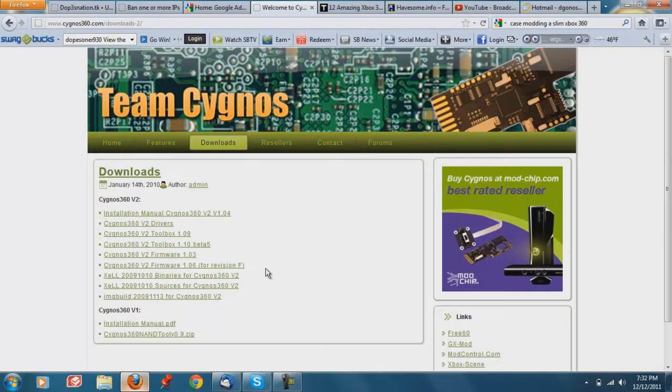Make sure that you have your Xbox 360's power plug plugged in, but don't turn on the actual Xbox 360 — just like when you're reading the NAND, just have the power plugged in. Then go ahead and get your USB cable and connect it from the Cygnos to your desktop or laptop or whatever you're using. When you originally plug it in, just like in my other driver install tutorials, you're going to get a little thing popping up saying installing device drivers, and it'll say unable to install or device drivers were not installed properly.